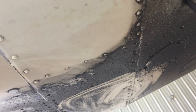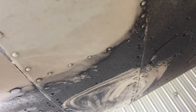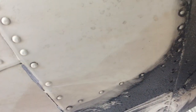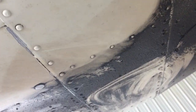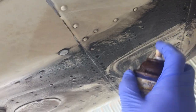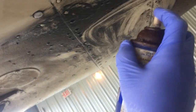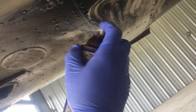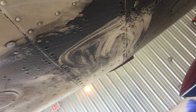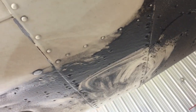As you can see, there are very heavy built-up deposits of oil, grease, and dirt on the belly of this plane. This area is already wiped off. The beauty of this is that most degreasing cleaners you can commercially get do have corrosive properties, which is something you'd want to avoid in your aircraft, especially these older aircraft that are prone to corrosion.